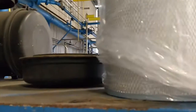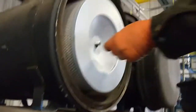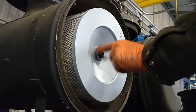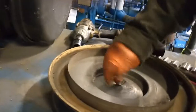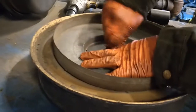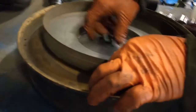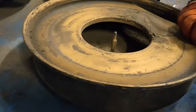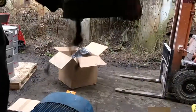Now we will change out the air filters. Start by unscrewing the bracket on the top of the air filter and pull out the old air filter. Install the new air filter rubber seal first, then secure it with the wing nut in the middle. Disassemble the cap of the air filter housing by unscrewing the wing nut in the center. Now we need to clean the dirt out of the end cap of the air filter housing — lightly shake and tap the cap with your fingertips until all the dirt is gone.